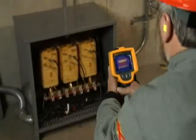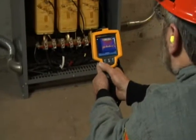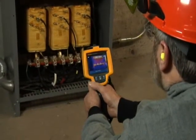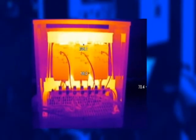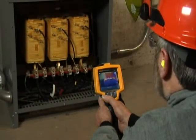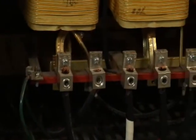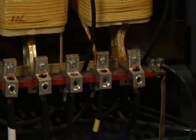Determine the hazard risk category for the job, either from the arc-flash label or, if not present, from the tables in NFPA 70E. Compare the temperatures of similar components, such as terminations and coils, to one another. A higher temperature on one phase may indicate unbalance. A higher temperature on the neutral termination may indicate the presence of harmonics. If the temperatures throughout the transformer are substantially higher than expected and the unit isn't in direct sun, you have a problem with overloading and cooling. Another thing to look for in a thermal scan is loose connections — long-term vibration can loosen connections, causing both overheating and excessive buzzing.